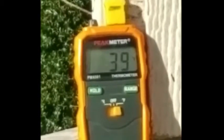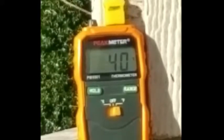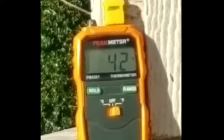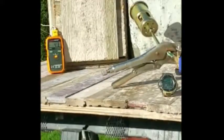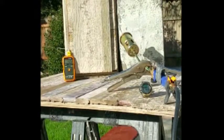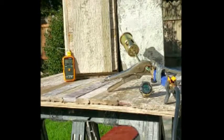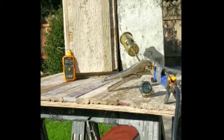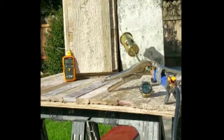I put the meter probe on the inside, on the very core, and I measured the time it took for that core to reach an ambient temperature of the outside air once I opened the oven door. The composite block on the right took about 60 hours for the core of the block to reach ambient temperature. The box on the left, which is made of industry standard materials, took about 20 hours. So we can conclude almost that the composite block on the right has 3 times the U factor, or R factor, however you're looking at it, than the industry standard.